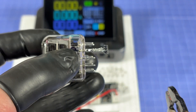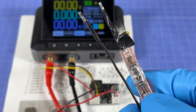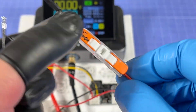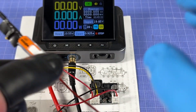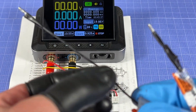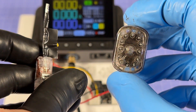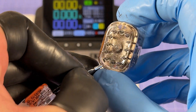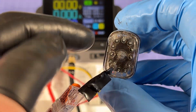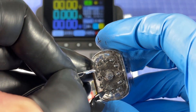I've connected my 15k resistor to a wire with a DuPont connector and a wire out the other side, and also prepared a plain DuPont connector on a separate wire. The anode — pin 1, the one with the arrow — gets the 15k resistor. I'll insert that now, and then connect the other wire to a cathode pin.